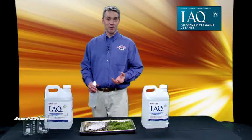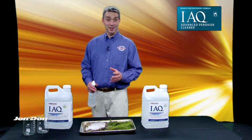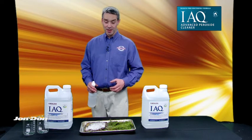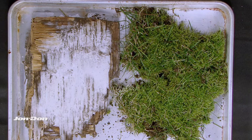In terms of whitening and brightening on wood, it's important to remember that your maximum whitening and brightening doesn't actually take place right away. Your stain removal comes later. Your lifting action is immediate. But leave it on if you want to remove stains — even 24 to 48 hours — and you'll notice how progressively whiter and brighter surfaces like wood can get.